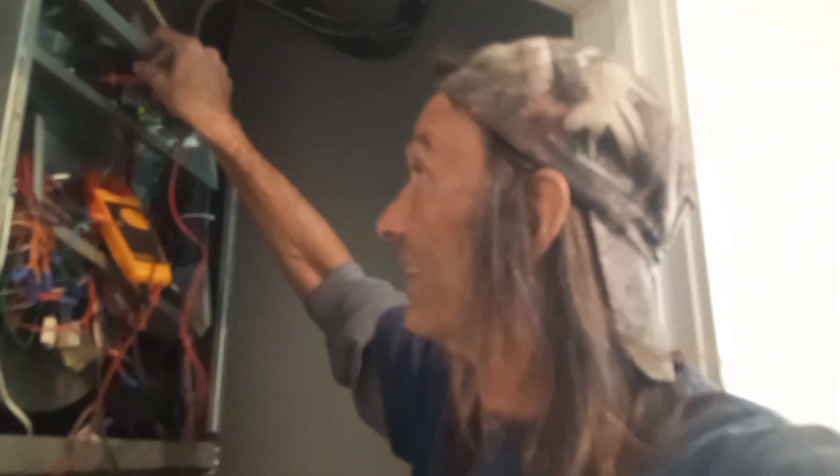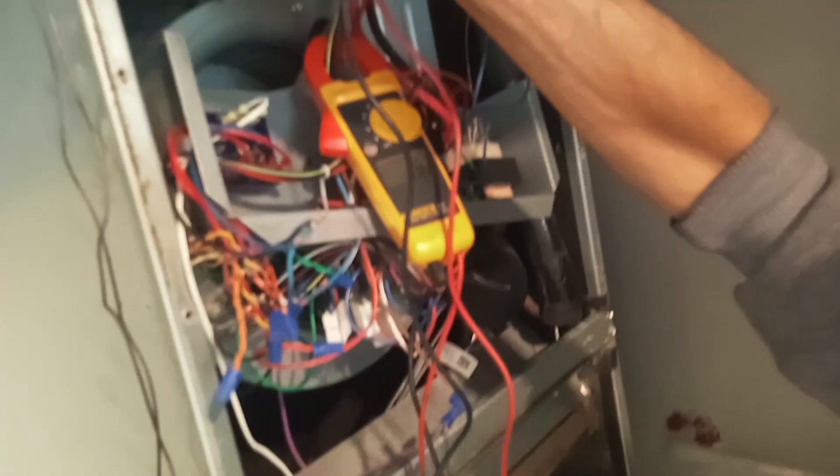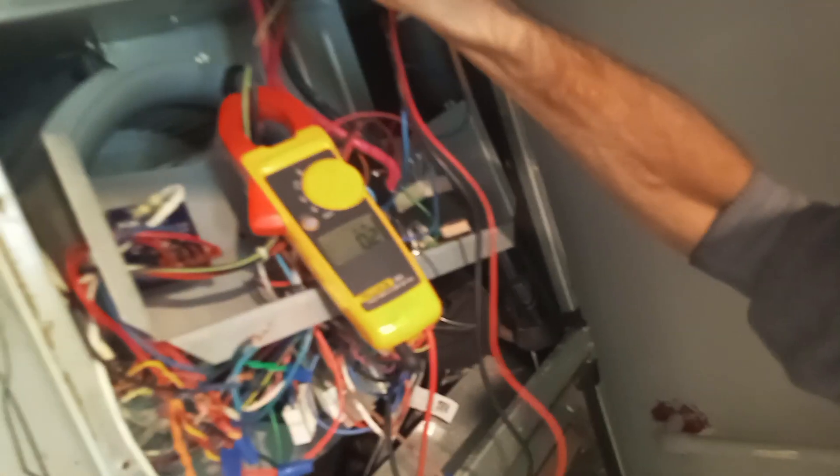You know the answer — go ahead. It'd be a lot easier than trying to do all this stuff one-handed anyway. Now I got zero volts — zero volts coming into the unit because I turned the breaker off to the unit. So now you think you're for sure good, right? You check it — it's got zero volts. Now watch this magic trick that'll put you right in a graveyard.